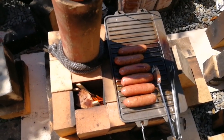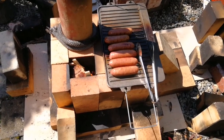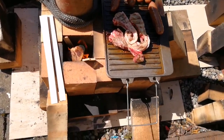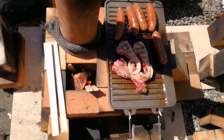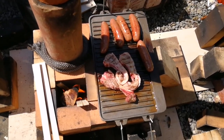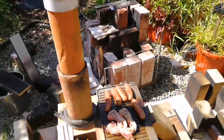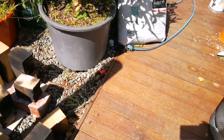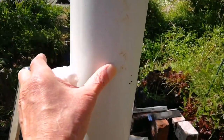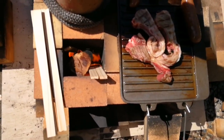It'll probably be better if I were to seal all the bricks with some fire clay. Well, this is definitely quite promising. I can't hear the rocket now because of the sizzling. I'm getting about 220 degrees Celsius from the cooking plate. The smoke seems to disappear - I can see some heat haze, and the chimney area is still touchable. The fire is following the horizontal burn path.